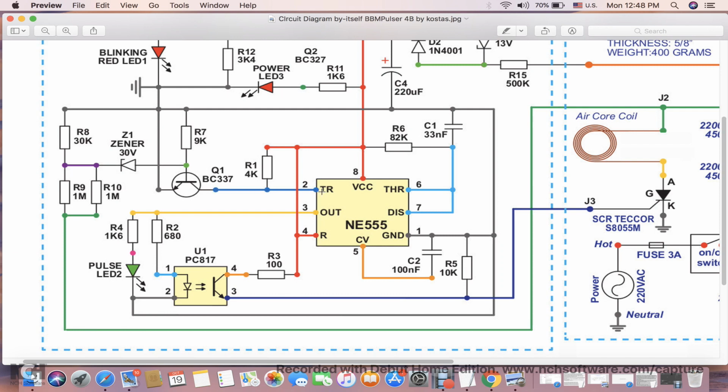Now this line here is a trigger signal from the 555 chip, and it's connected to the 4K resistor. This resistor is connected to the positive. This is a positive here, 12 volt, and it's constantly keeping the trigger high, so that on the output, sorry, the third pin is output, you will have 0. So as soon as you lower to 1/3 of the VCC voltage potential here, you will trigger a pulse.